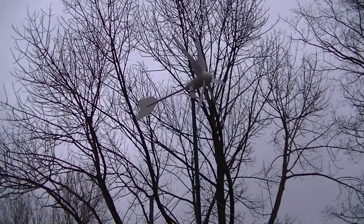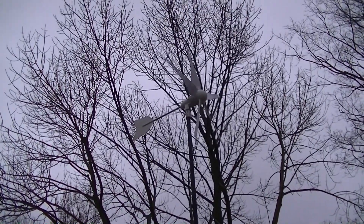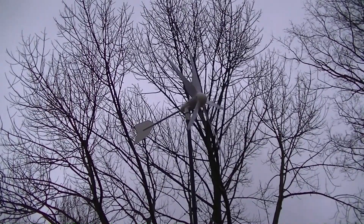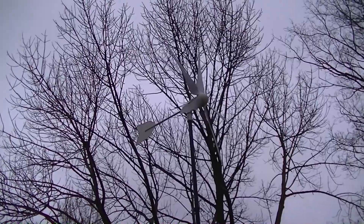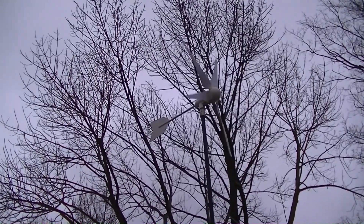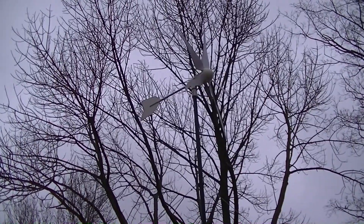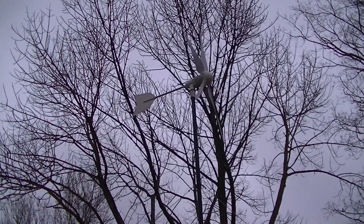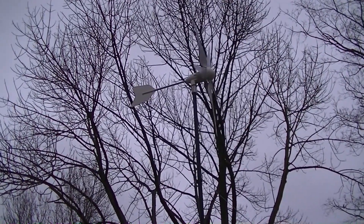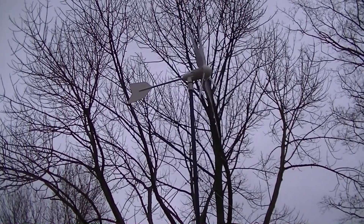We're supposed to get some wind this week, so if we do I'll get out here with the camera and hopefully get some power readings. Right now the only thing I have it hooked up to is my 22-to-60-volt inverter. It does not like the 10-to-30-volt inverter at all because it is a 48-volt model — it overvolt's it very quickly. So I'm not even going to bother using that.